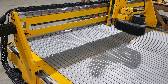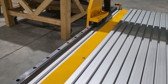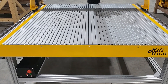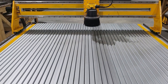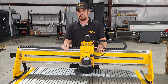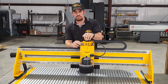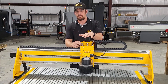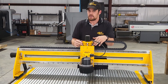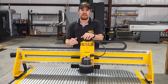With this machine and careful setup you could see two or three thou parts, and it would be totally reasonable to use this machine to make bearing interference parts or anything that you might have to press into another — that's well within the capability of this machine. Some of the other differences are that this machine is ball screw driven while the MegaV XXL is a rack and pinion drive, which is part of the reason for the difference in accuracy. Beyond that is just the rigidity of this machine — it's very stout, made from five-eighths aluminum in most places, precision cut on our industrial milling machines. You also have the large linear bearings that are frankly oversized for this application, but we wanted to make sure we were delivering a machine that could really serve your needs for that light industrial or heavy use commercial customer.